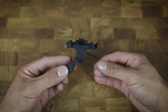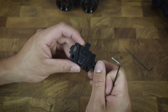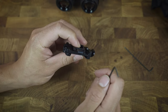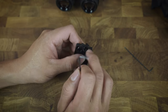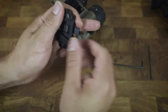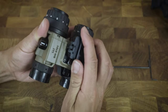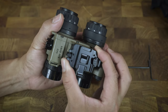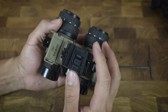If you find it still has a little bit of wobble, you can back out all the screws and try again. Loosening the dovetail is a bit of a different affair — what's interesting about this system is that the worm drive only really works one way pushing out. If you want to loosen it you have to unscrew the retaining locking screws and then loosen the worm drive screw. Put it on and that's pretty perfect. I like it really tight — just that perfect amount of pressure. The dovetail has zero wobble and you've eliminated that aspect of your knobs wobbling.